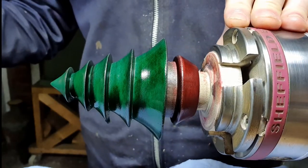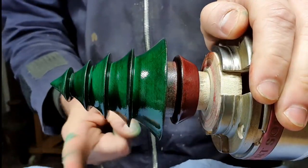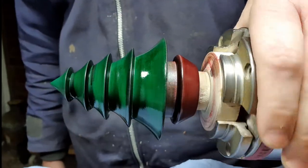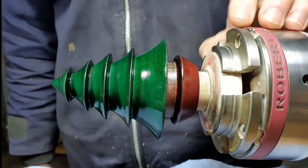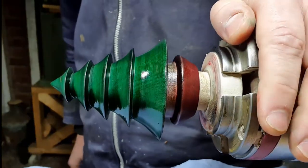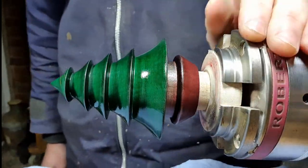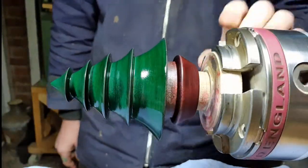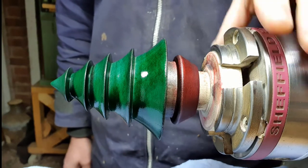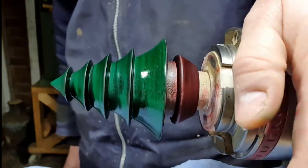That's a good healthy coat of ebonizing juice. As this dries, especially if it's on a lathe, you'll find it pools under the bottom, so if you're hanging around make sure you give it a half turn every now and then to spread it out — it'll help it dry more evenly and may help avoid dribble marks. As I'm talking you can see it going a little bit darker. It won't dry like this, but we'll see in a few minutes when it has dried — it's nice and shiny now but it won't be when we come back.